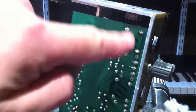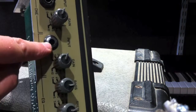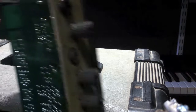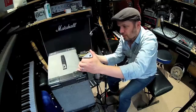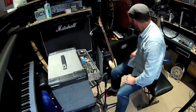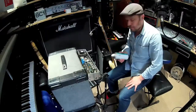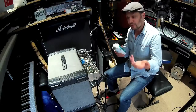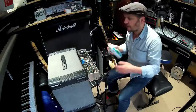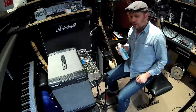Here is the underside of the preamp. This jack plug's been replaced before — the solder is a little different and the front cover is different. The other Carlsboro ones have got metal jacks with colored washers. Since these are spring connectors, a very good way of cleaning them is to use an air duster — a can of compressed air. You can get these from Maplin along with soldering irons, solder, and other tools. You can really get a good toolkit for 20 or 30 pounds.